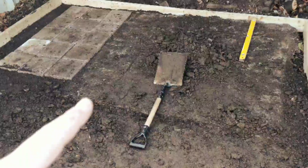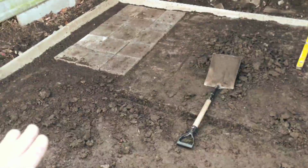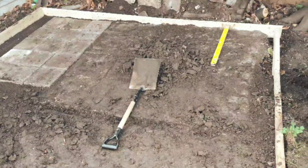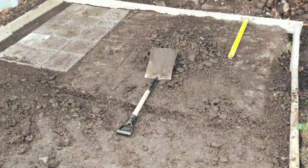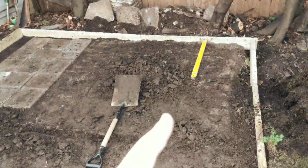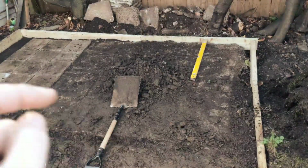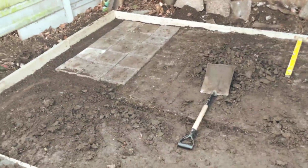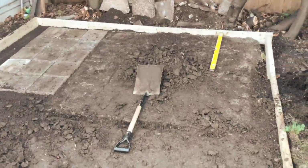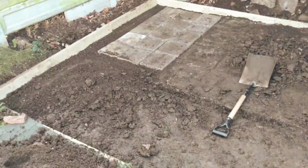So having superstructure underneath, spreading that load out, sand on top that goes hard, flags on top, I'd say that's an over-engineered base for a shed. Plus, all my heavy tool work, my workbench is going in this corner. Probably an L shape or something, so that's going to be the hardest point anyway. Not that it really matters, the whole thing will be solid. But I'll have a bit more extra peace of mind that underneath my feet, in that sort of third of a corner there, is going to be rock solid.